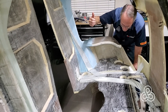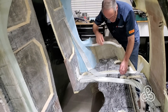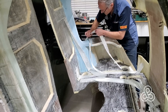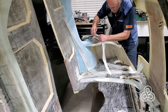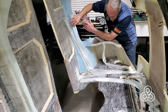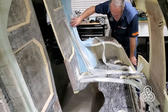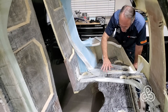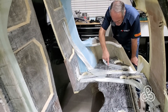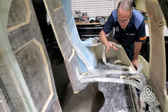These fiberglass tapes will spread from the bulkhead, run along the longeron, and up to the hardpoints for the front subframe as well. That area is currently upside down so we'll have to wait until we start doing those laminations in another video. But you can see how these tapes allow focused intent on some of the strength areas — spread out on the bulkhead and then focused strength up along the structure, creating rigidity. We are only less than 10% done with the fiberglass laminations on this tub right now, just creating the shape so that we can start working on it.